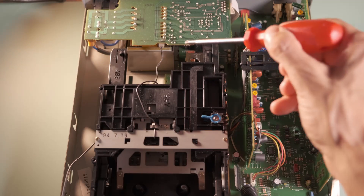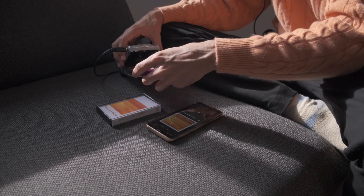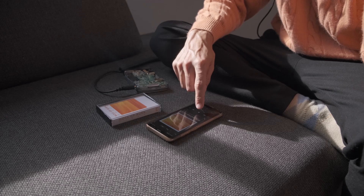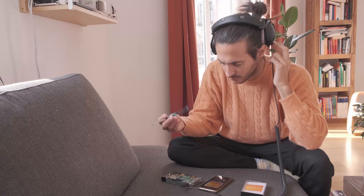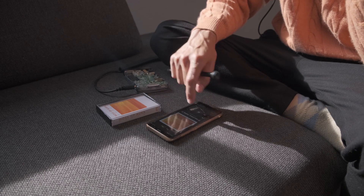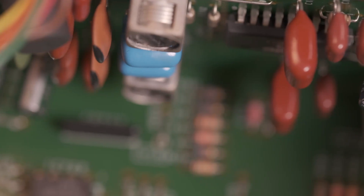For Method 1, you will need to pick one of your favorite tapes with a song that you know by heart and that you can also reproduce on your phone, computer, or CD player. After plugging in your cassette deck or recorder, it's very important to make sure not to touch anything else on the open circuit, especially the transformer, or you might get shocked. Play the song at the same time on both devices and see if the cassette player is dragging or going too fast. Tweak the calibration screw to the pace you find right, and play the song again till both align perfectly. Of course this isn't a particularly scientific or accurate method, but it will fulfill the sonic needs of most people.